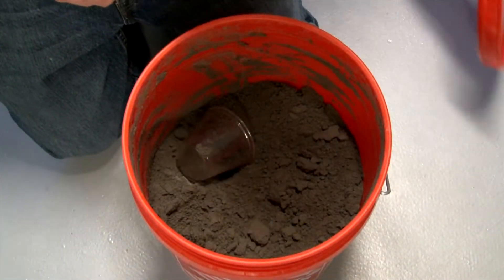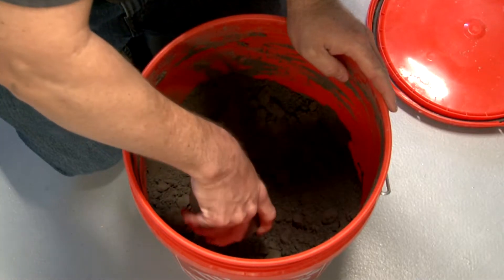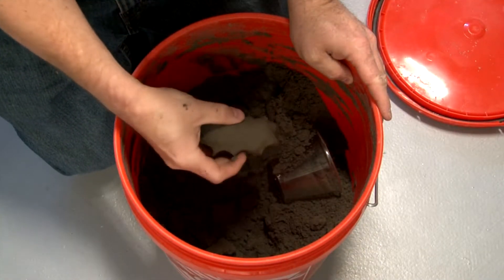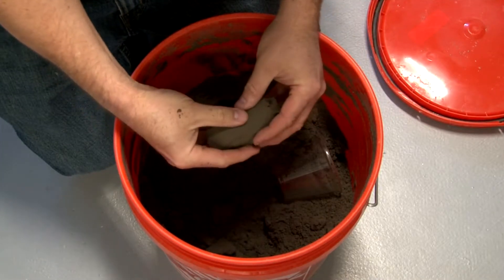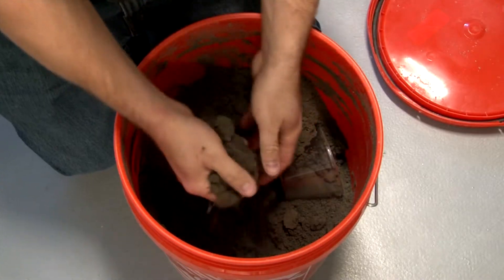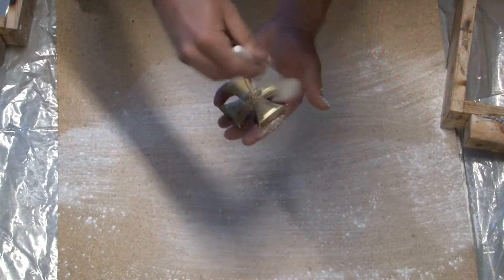Here's my sand. I'm checking my sand to see the moisture content. One of the ways to check it is just pick up a handful of it and squeeze it. I'm making a little bit of a mold in my hand and breaking it. You can see it breaks cleanly. You can also see the moisture is not high enough for the sand to stick to my hand, so that's in good shape.